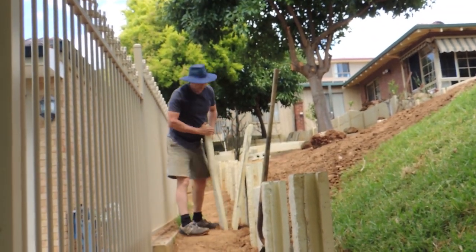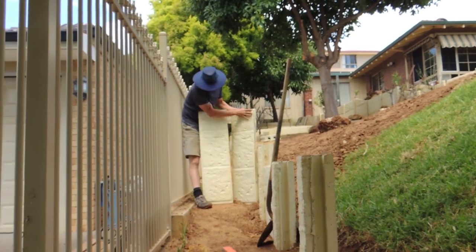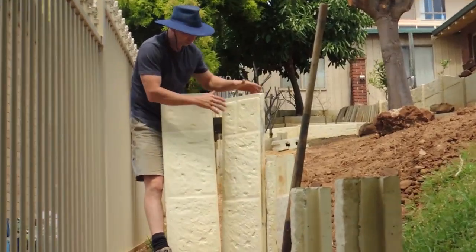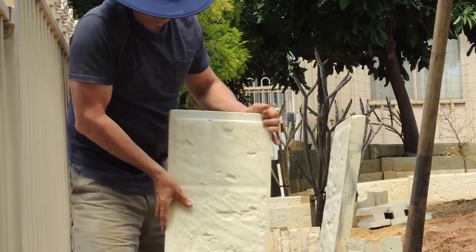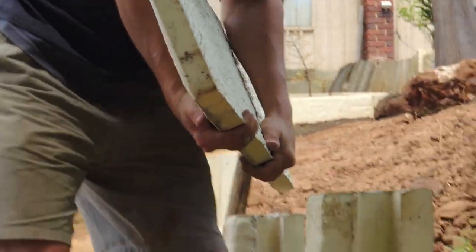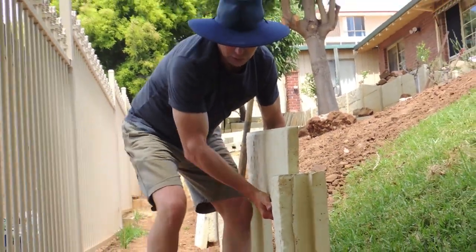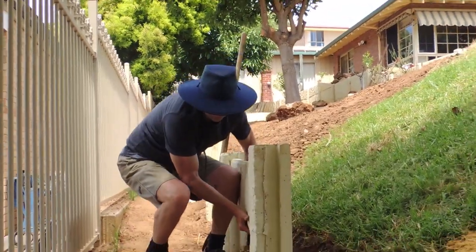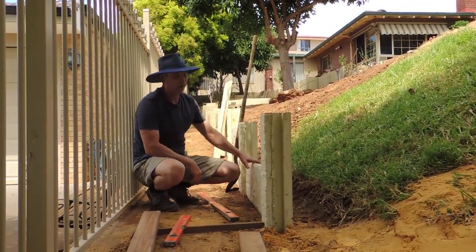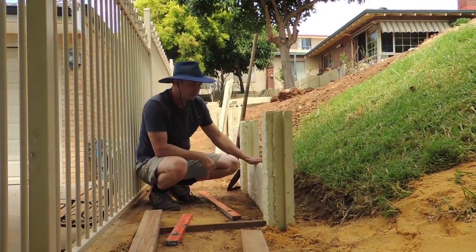Remember — there's a pattern on the panel, and a small section is on top. You want to reverse it to give that realistic look of a brick wall. Grab it by the middle, slide it in — don't drop it, you can put fractures in it. These panels have three rods inside them. Take that first one down gently. Even if you put a hairline fracture in it, they're not going to fall apart because the three steel rods running through keep them very strong.